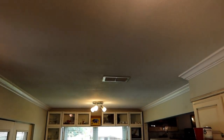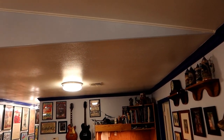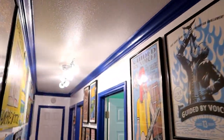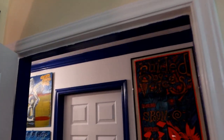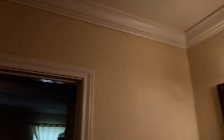To assist in this whole process, I've literally gone into every room in the house and turned on every light. That way when I power things down and then power up one breaker at a time, I'll be able to get an idea where the power is going — that'll give me a clue where to look. There are dozens and dozens of outlets in this house, and I'm guessing probably in most cases the same breakers that control the outlets probably also control the lights too.